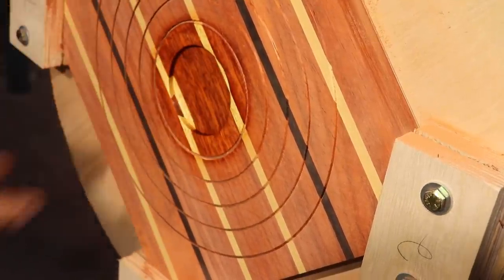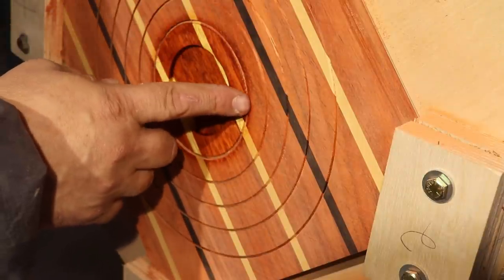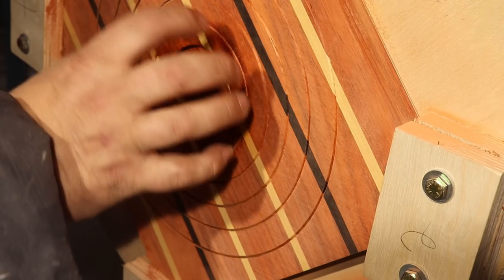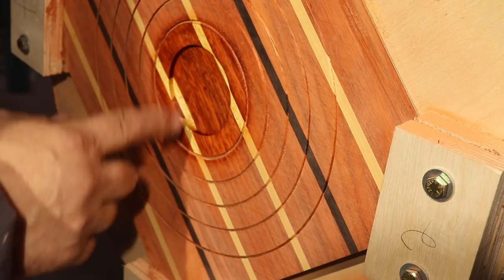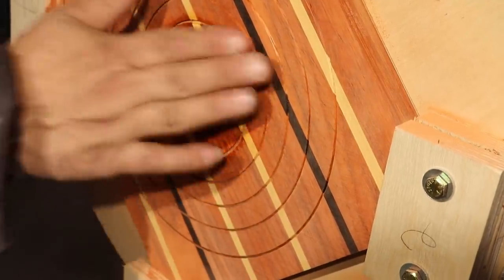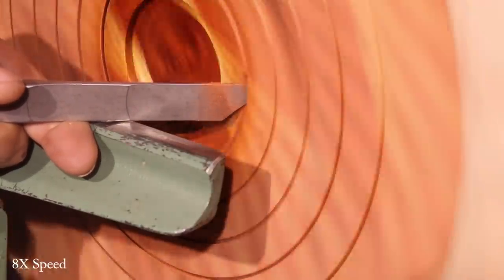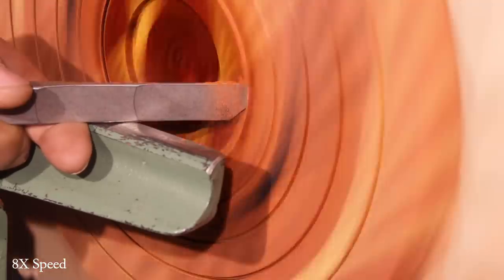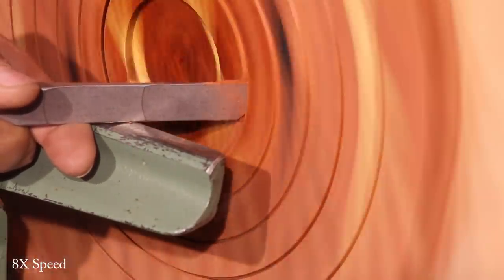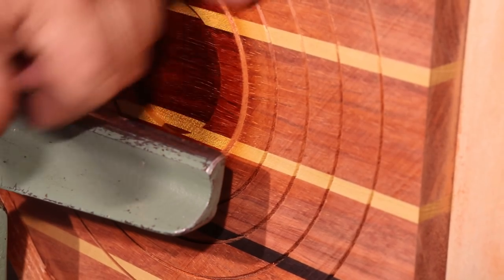The only thing I'm curious about, I'm going to go very low RPM. The only concern that I have is that when I get through the ring, is it going to bind my parting tool? So I'm going to be really careful, go nice and slow, and take a nice light cut with that, and we'll see how it goes. I actually think I should cut quite a bit out of most of them before I finish out one.